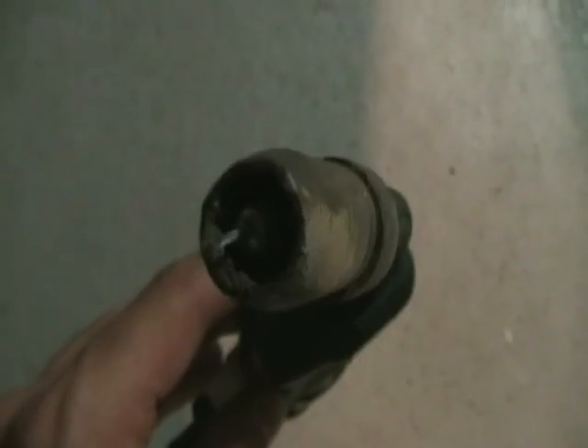The difference is you'll need to buy the wire plus spend around $200 or more just to rent the gas bottle, since you're not allowed to buy them these days. You have to rent the right gas — some gas is different. This gas I have is for welding aluminium; for steel you want to use CO2 and argon.